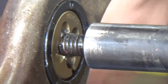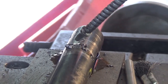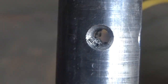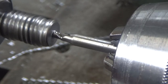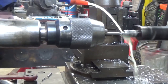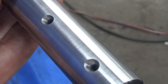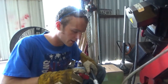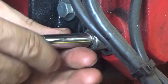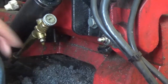Just standard M12 threading on the end of this pin. We'll spray some WD-40 on this so hopefully it'll just slide right in there a little bit better. Can't be having these things vibrate loose as the saw runs. Just a tiny bit of tension and it's in. Both ends are officially greasable.